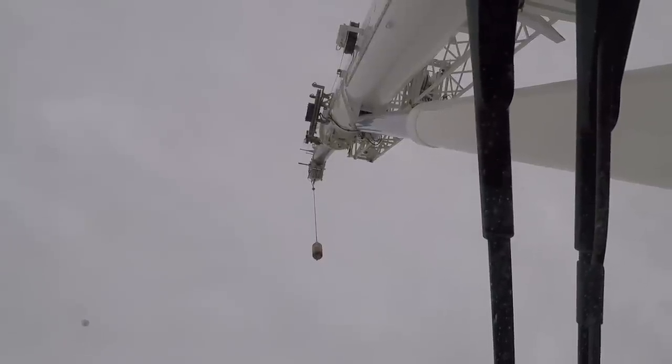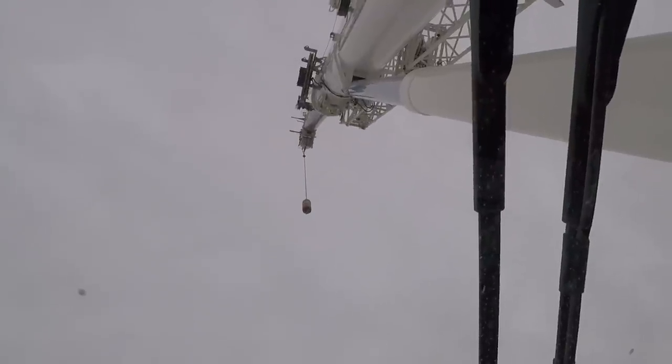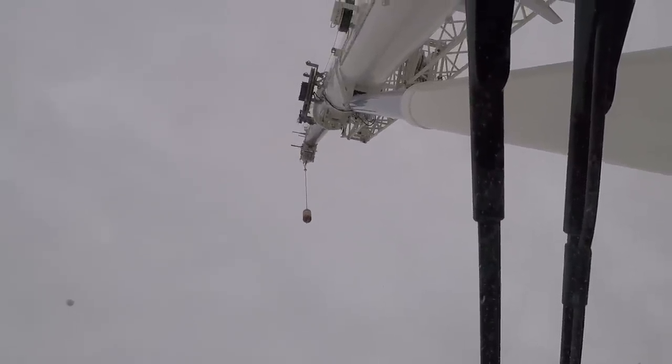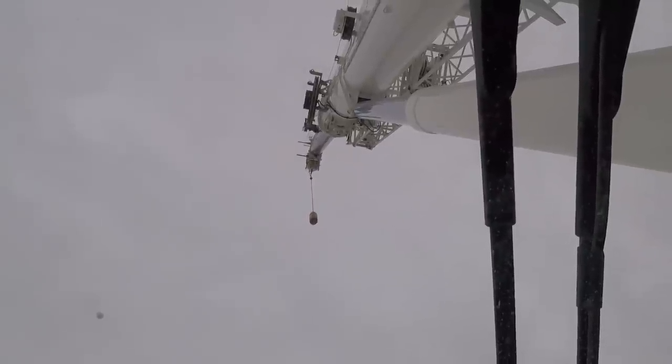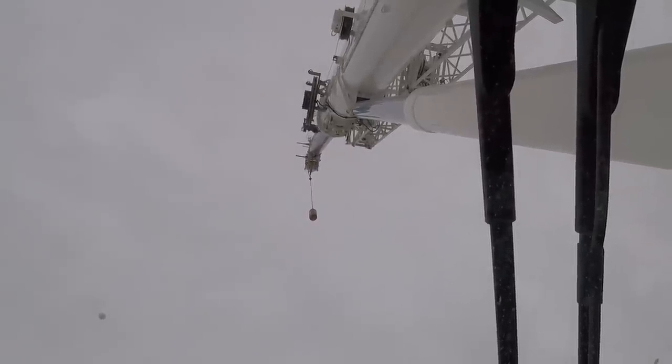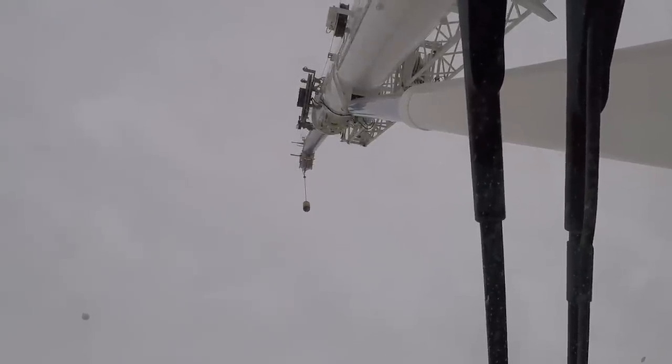I can actually run it in high speed — there's a button on the front of the joystick that puts the function you're operating into high speed mode. But I generally don't extend and retract this boom in high speed unless there's lightning, wind, or I just need to get it out of the air in a hurry. Especially in the cold — the grease on the boom is cold, the wear pads are cold, everything's kind of sticky. I think it would just be hard on the equipment.